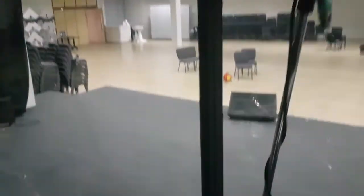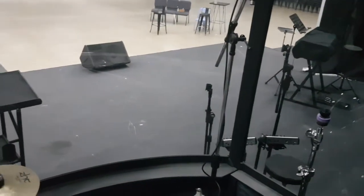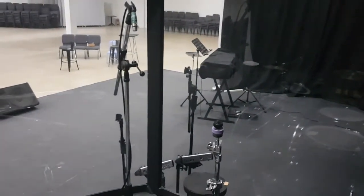Basically this side is one unit that's built, and the front is a separate unit, and they just screw together. The sides and the front are three separate pieces and I screwed them together right up in here from the back. The basic idea of three layers of plywood with the middle layer being a little shorter to create a groove for plexiglass, and designing it so the front takes a whole uncut sheet and the sides take a half sheet, made this really cheap and relatively easy to build.